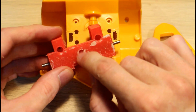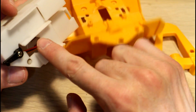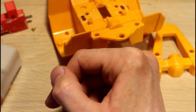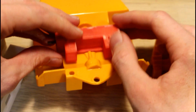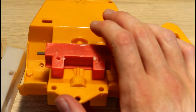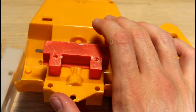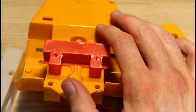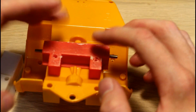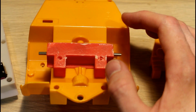I need to put wires on the motors first and thread them through - I left a hole for the wires to come through. They'll go through this piece of the model, then up where the gears used to go, follow the servo wires, and come out alongside the servo wires. I'm going to have a normal motor driver in the front and have the front act as a tractor - exactly the same code as the Ford TW35, with a differential giving two independent motor speeds when cornering.